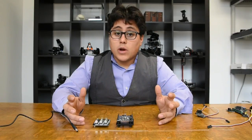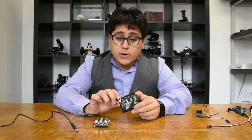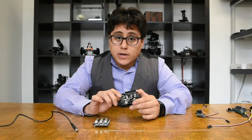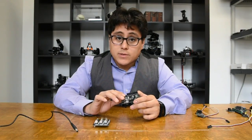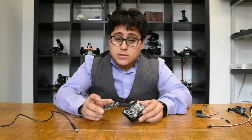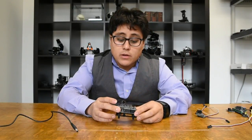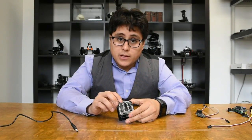Let's take a look at how easy it is to wire up the RobotGeek system. First I've got my Geekduino or other Arduino compatible board. I've got some firmware already loaded that will interact with some sensors loaded in the Arduino environment. I've got my RobotGeek sensor shield, which fits right on top of your board and breaks it out into all of these 3-pin connections.